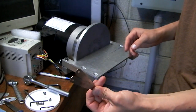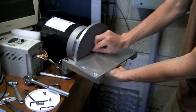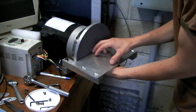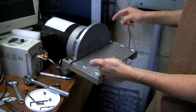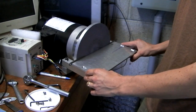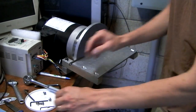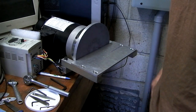So I've got 50 thousandths worth of shims right here, just what I happened to pick. It was super close and easy. So I just put them in there. And on second thought, each one's 25 thou. I think I'm going to go for 25 thou gap. Why not? So I just have to adjust things, get these 4 bolts in. So there we have it.